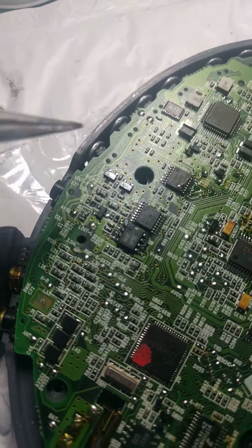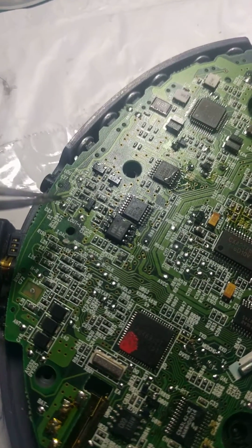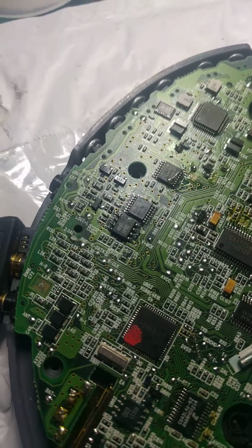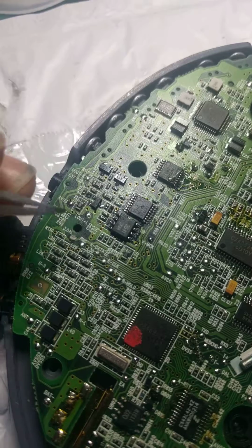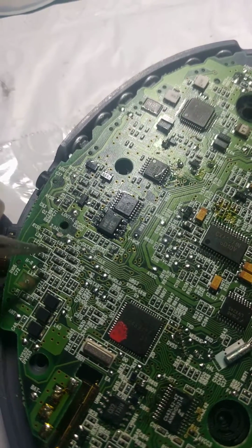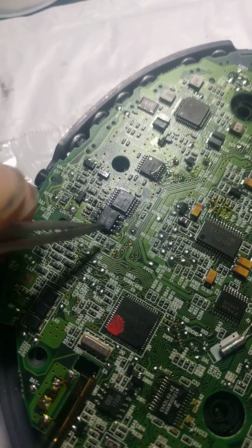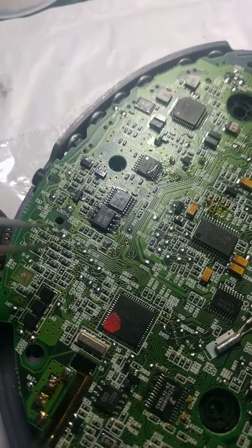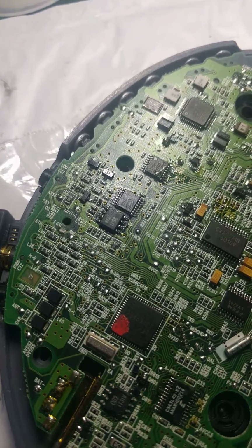And so then you kind of want to look around and see, well, what could fail on the analog side of things? Sometimes you'll find there'll be a small ferrite bead inductor in the path of the audio signal. And you can go searching around this tiny board, these tiny parts, for that ferrite bead inductor or for an output capacitor. What I find is often easier is finding a large chip that would look like an op-amp stage, which would amplify the line output.